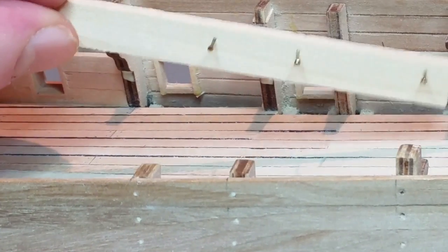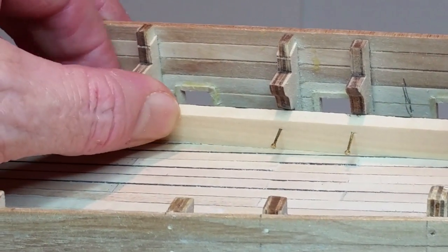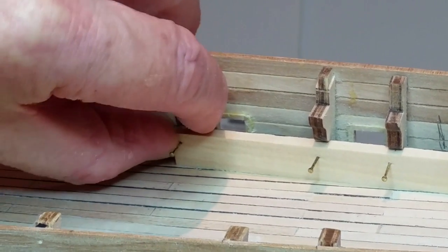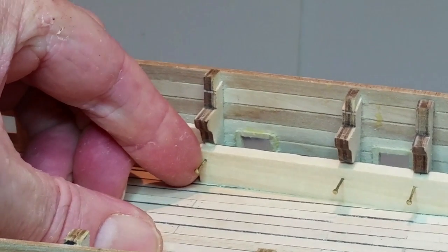Then cut a further 4 strips of 4x11mm wood to 25mm long and 2 lengths to 15mm long. Once again paint the outer surfaces black, then glue these pieces in position behind the gun ports. As these support beams will be inaccessible when you drill the holes for the dummy gun barrels, it is a good idea to add some scraps of plank to reinforce the joints.